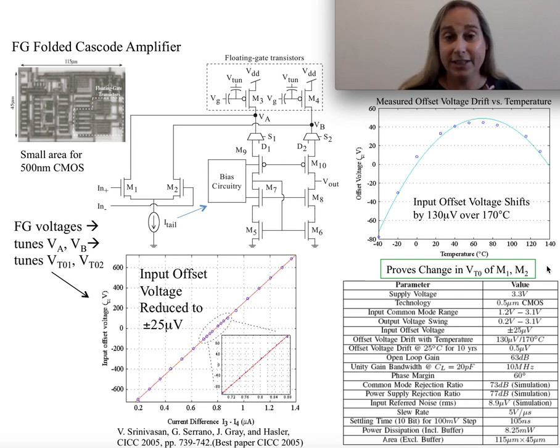The only way you get that is if you are fundamentally moving the physics in the structure. You could argue that you could probably get this even flatter if you were building floating gate elements into these additional spaces — which clearly proves the case. It turns out this is a very, very powerful approach. One that really shows one of the interesting ways of using floating gate elements, where the floating gate elements never enter the data path and have no practical impact on it — and yet they have a huge impact on the bias behavior. That turns out to have great implications, making this a really impressive structure.